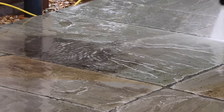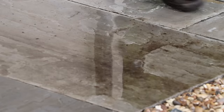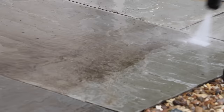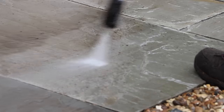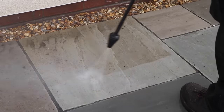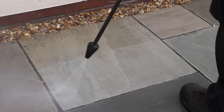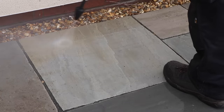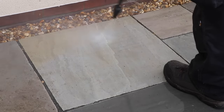I think only mechanical cleaning has the power and force to cut through twelve months of dirt build-up and clean the surface properly. While going around the house with the pressure washer, I decide to change to my rotary turbo nozzle that spins around and is supposed to cut deeper and quicker. It works sort of okay, but I don't find it any quicker — if you move too fast it leaves a spiral shape that it hasn't cleaned, which means you need to give it a second go, which then slows you down.